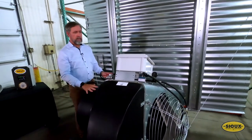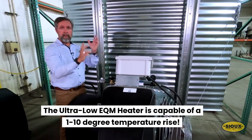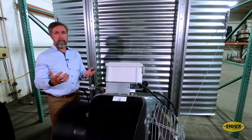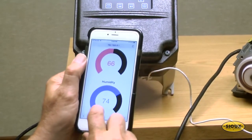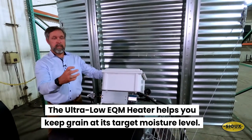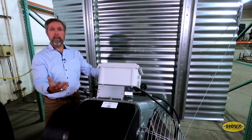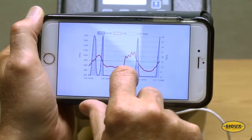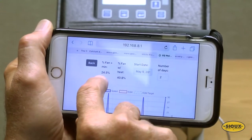Just on the heater itself — we're looking at a 1 to 10 degree temperature rise. All we're looking to do is take out a certain portion of humidity in spring and fall, which gets you that longer season. We don't need 140 degrees; we only need that 10 degrees, which just knocks the humidity down to something that fits your EQM chart for your latitude. When the box senses higher humidity, it adds heat. In wintertime with colder temperatures but lower humidity, it's only going to add the heat needed to make sure that balance is still maintained.